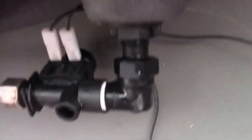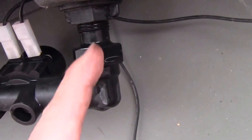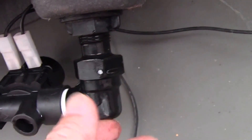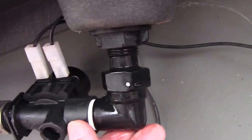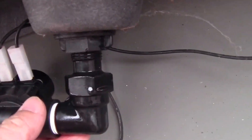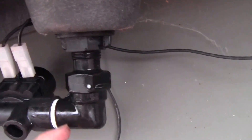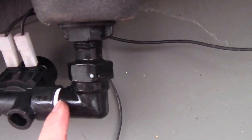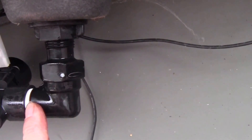I've just changed over the valve. What I found during the process was a leak coming out of here, and it was also possibly leaking here, just due to me twisting the elbow back and forth when removing and refitting the valve. What I ended up doing was putting a bit of Teflon tape here — about three turns, three layers — before fitting the valve on.